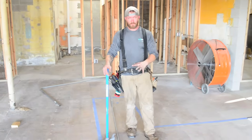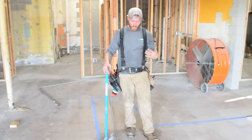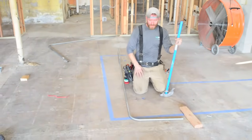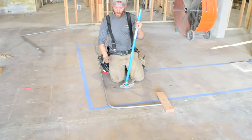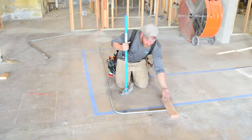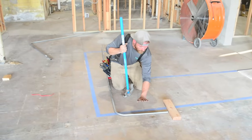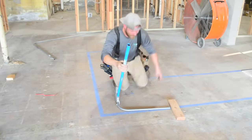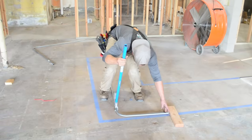Okay, the last scenario that I'm going to talk about is what's called a kick. A kick is only half of an offset. The reason that you would use a kick is if you're coming from whatever source you need to pull wire from, and you're turning a 90, but you have an obstacle in your way, you don't have to bend an offset, because you're not going to go straight after that bend. You're actually turning. So you don't have to do anything but seriously just kick this pipe up. It makes this whole 90 and everything move up so that you can just keep going with your run. So a kick is seriously the easiest way, the most joyous way to bend something, because you only have to do one thing. It's very easy.